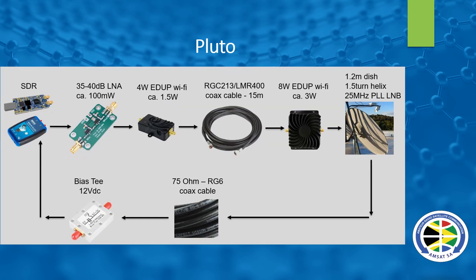This is the ubiquitous ADALM Pluto SDR, and on top we have the Lime SDR. Looking at the Pluto block diagram — you go from the Pluto, through a preamp, a long piece of coax, then into the Chinese amp and into the dish. From the dish back you go through your bias tee to keep the LNB going, and back to the Pluto. It's a nice little transceiver. We do a fair amount of modifications — we change the base frequency range from 70 MHz up to about 6 GHz, and there are software changes to accommodate DATV. We also throw out the 25 parts-per-million oscillator and replace it with a GPS disciplined oscillator.